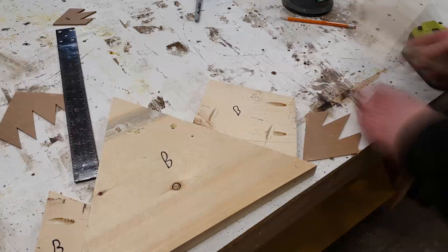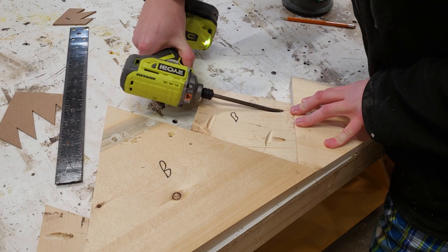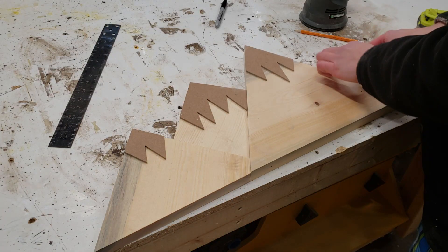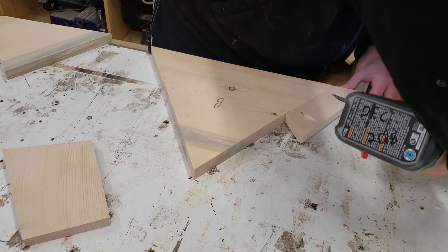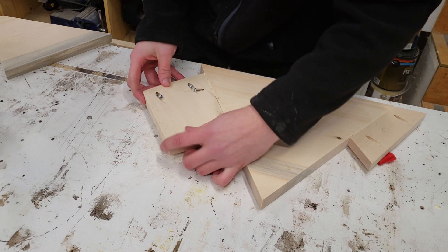To attach the last piece I shoved a piece of hardboard underneath and simply drilled in the pocket screws from the back. I can then lay out the frosty hardboard tips on top to make sure they're all the right size. Once they look good, I go back, remove the pocket screws, add glue, and put the screws back in to act as clamps for the glue.